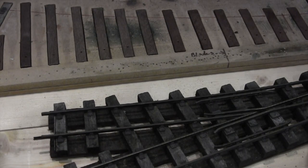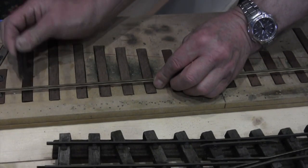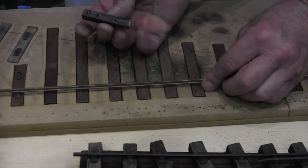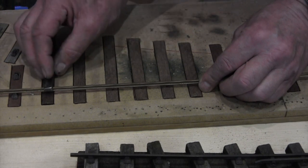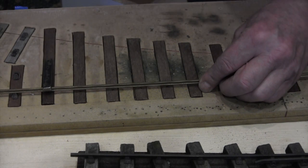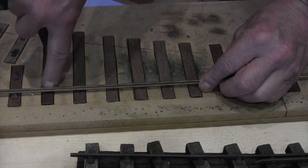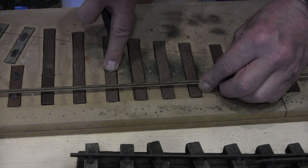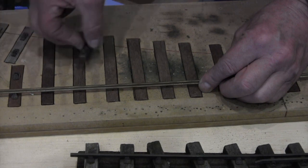This is going to be a little difficult because I'm not actually constructing. So, assuming you've got that rail in, it clips over that rail that's in position, and the holes that are drilled in it, there's actually two in this because it's made to do dual gauge, 32 and 45. With another drill, the last drill of the set, you drill through there and it produces at the correct 32 mil centering your shallow hole for those three check rails. So there, and there. You would also use it there, and there.